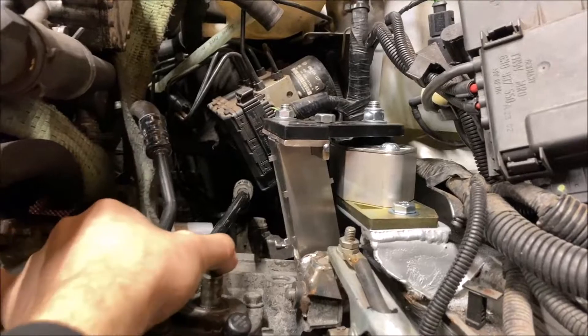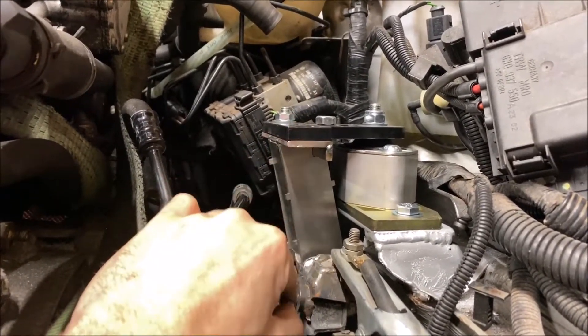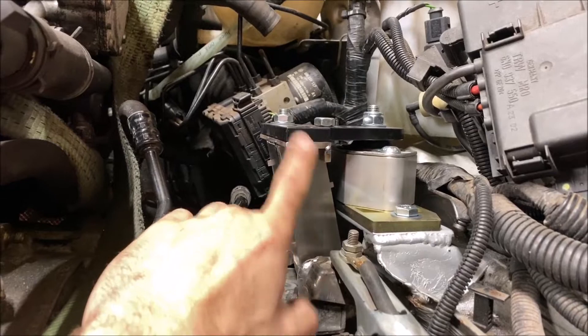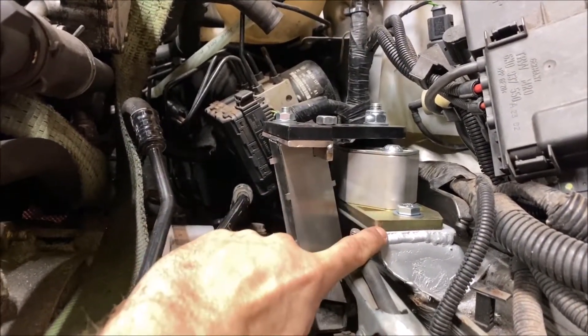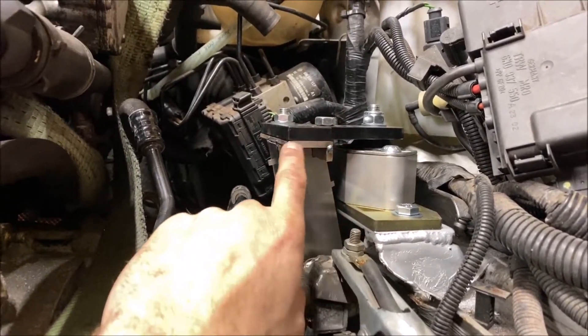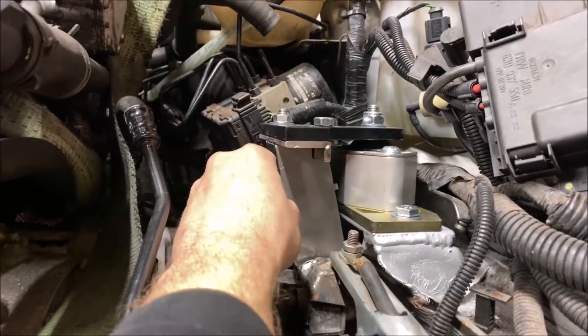This is the inner section of the mount. I'm doing basically the bolts piece that we've already made, which is bolted to the gearbox. It's then going to be the piece in between which mounts to this part of the mount and then obviously goes through the mount south to the chassis rail. The quickest thing is to chuck this on so it's bolted in - there's a 5mm piece made with basically two holes to take up that bit and then we're making the rest of it.